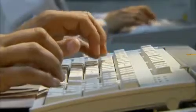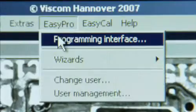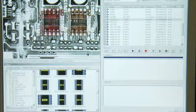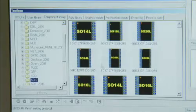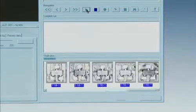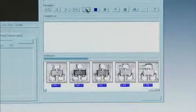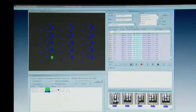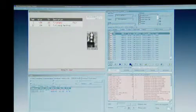Inspection programs are created through the EasyPro 3D user interface. The printed circuit board data in a commercially available file format can be linked with the IPC-compliant VISCOM inspection library very easily. Thus, the system operator can generate an inspection program in the shortest time. The integrated defect verification assures program changes do not cause defect escape and at the same time improves the false alarm rate. This raises inspection program quality substantially.